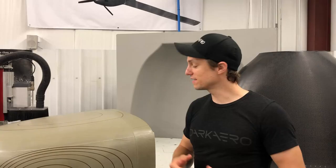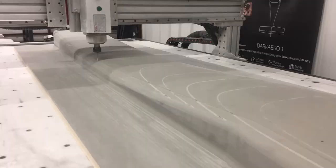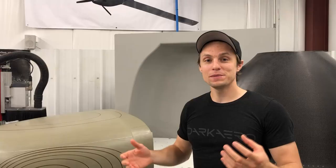That's really helpful for making edges that go all the way around and define where the edge of your part is. When you go to cut out your carbon fiber part from your mold, you have a feature all the way around that lets you cut your part to the same dimensions every single time. The third one is that tooling board is engineered specifically for machining — it machines really nicely, creates really nice chips, it's more enjoyable to machine than lower density foam or MDF. And once it comes off the router table and you do some light sanding, it actually sands really nicely too.